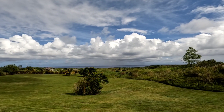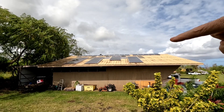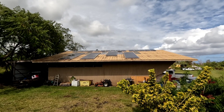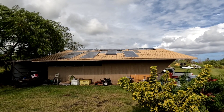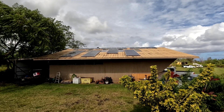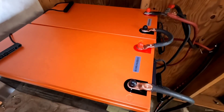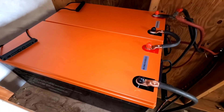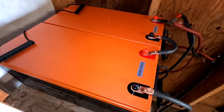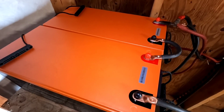You're going to recognize some of these components. If you look right up there, all the solar panels feeding into this system — this is a good-sized system. There are several strings of solar feeding a brand new battery bank that just got dropped in today. That solar panel array is six strings tied in series for four thousand seven hundred and seventy-five watts, and three strings tied together for three thousand seven hundred and fifty watts, for a total of eight thousand five hundred and twenty-five watts.